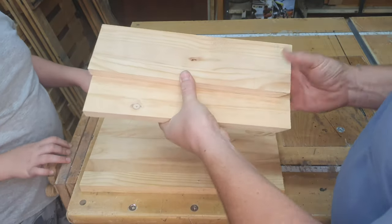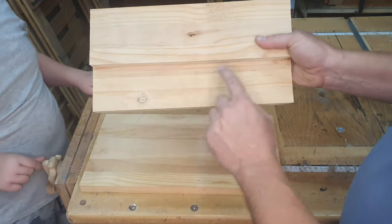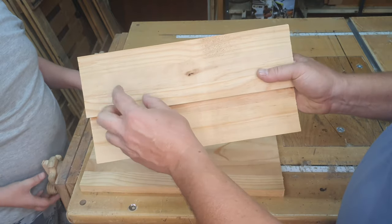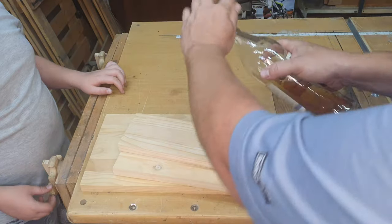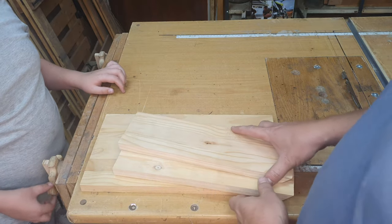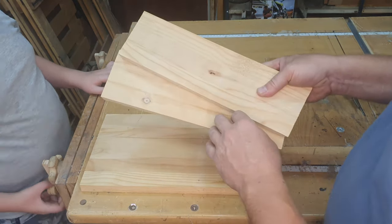For the wine bottle part, I plan on drilling three holes into each of these planks, starting from the top and spacing them evenly according to the size of the bottles. The holes will be sized more or less to the bottlenecks, so the bottle necks can just fit comfortably through the holes — for wine bottles or whatever bottles you plan on using.